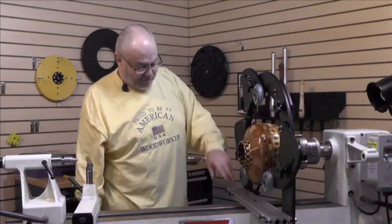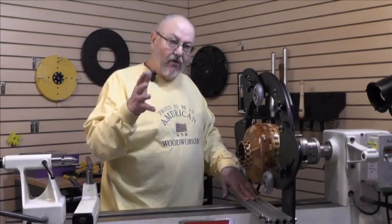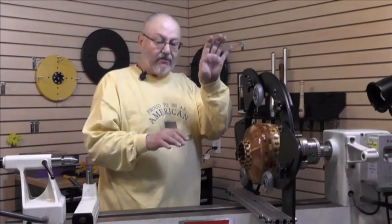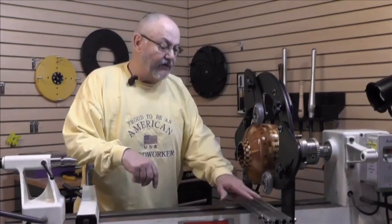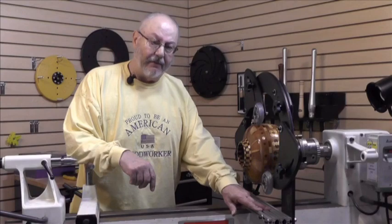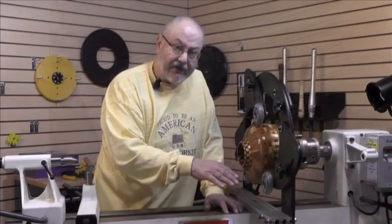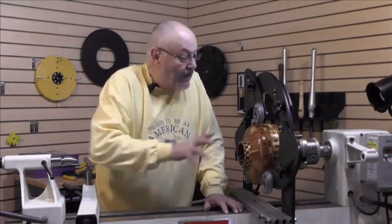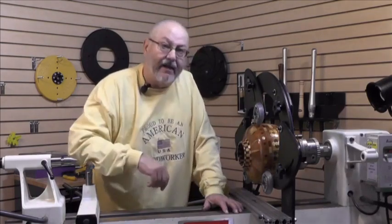The range on a 16-inch model goes from about 13¾ to 14 inches all the way down to about half inch to three quarters of an inch when you tighten everything up. The reason I chose the 80/20 type aluminum extrusion with all the slots is that in the future I can add accessories — something to hold a Harry Potter wand or a crochet hook — bypassing the big wheels and using a mounting point for smaller items, making it even more versatile.